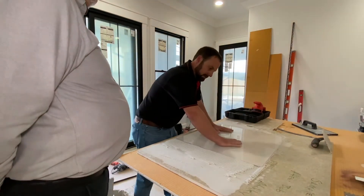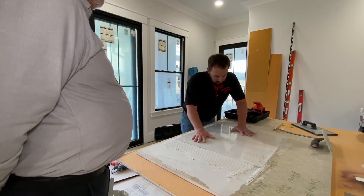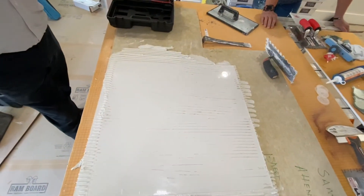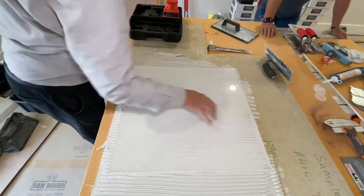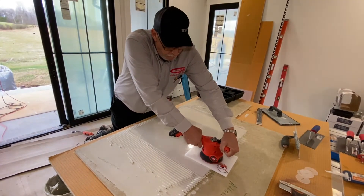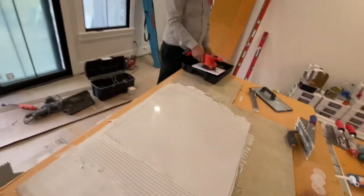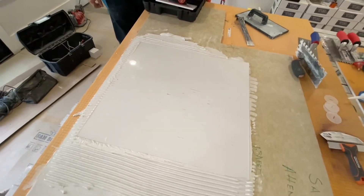We're going to take it, move it, and fold the ridges over. What percent coverage would you say we've got there, John? I'd say it's higher than what we had with the half inch by half inch — this is probably 75 to 80 percent. You can see this area here is almost 100 percent coverage, we've just got a little bit of voids. Now you can see we've got a lot better coverage by using the Montolit Batile Pro — that right there is about 95 percent coverage.